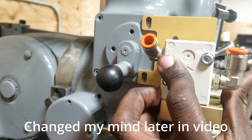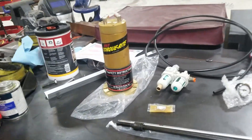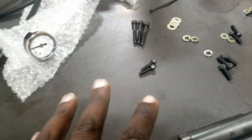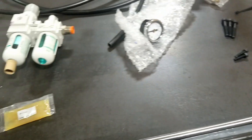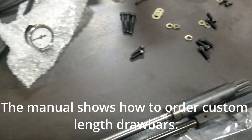For mounting this, it mounts here. It comes with longer screws. The actual unit itself mounts on the plate, just directly on top — you can turn it 90 degrees — and it uses the jacking screw holes. An important note: this shoulder needs to be 50 thousandths below the plate surface. Part of that is achieved by ordering the right draw bar for your machine. Let's get to installing.